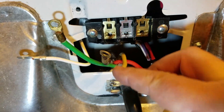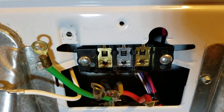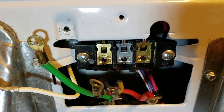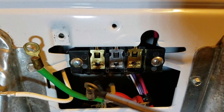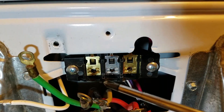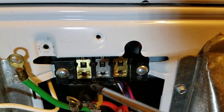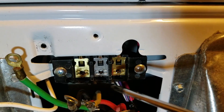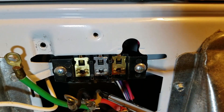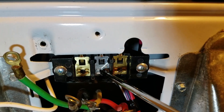What they're doing here is on a three-wire — and I don't have the gray three-wire cord to show you, so you're just gonna have to bear with me. At the end of this video I sort of illustrate that on paper. When you put a three-wire dryer plug on a modern dryer, you're gonna have a gray wire, a gray wire, and a gray wire. When you lay them out flat, the gray wire in the middle always goes to the neutral.